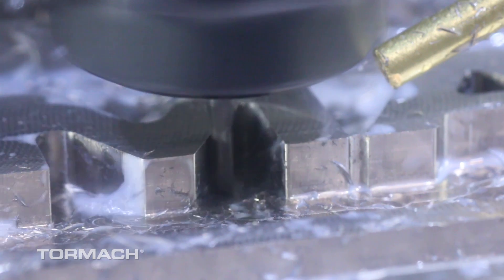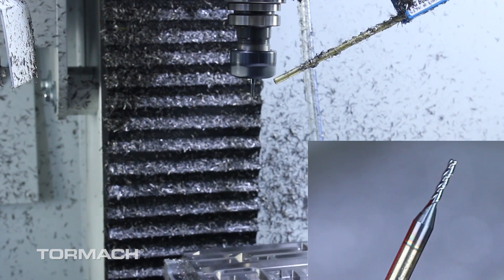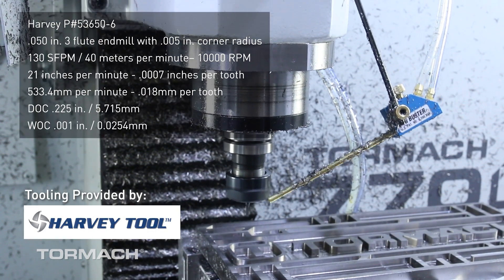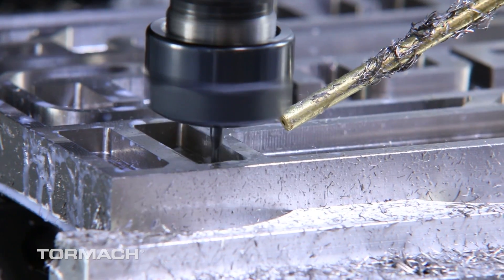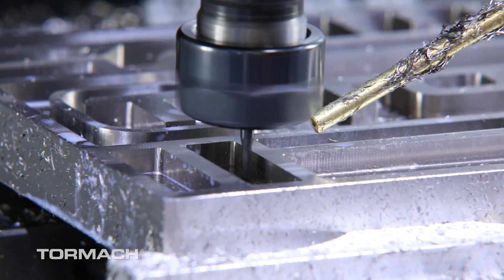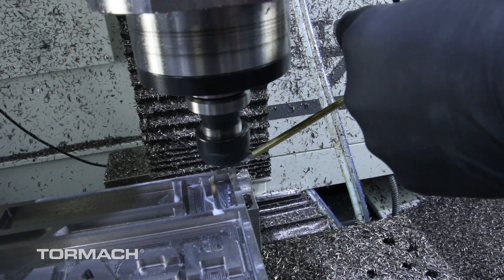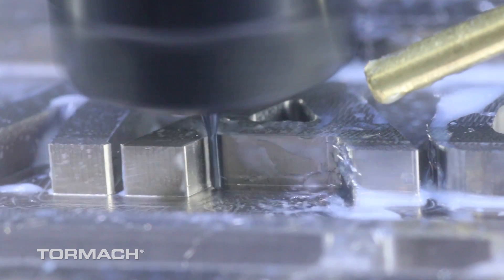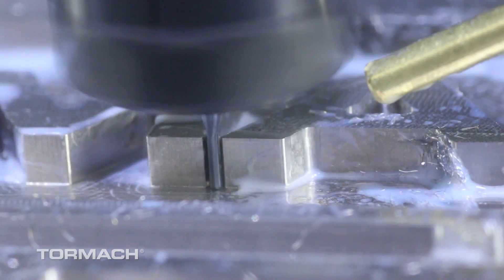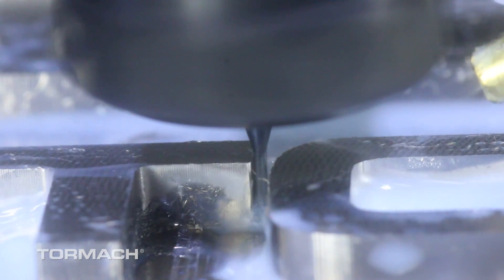The recommendations from Harvey Tool were excellent and everything just worked. Then we went down to that little 50-thousandths end mill. This tool kept making me smile — I've never run a cutter that small at that depth of cut before, so it was a fun experience, and much easier than I expected. We went full depth at 225 thousandths deep with a 2% step over, which ended up being a one-thousandth of an inch step over. One of the big things when cutting titanium is you can't be scared — you have to take a chip, otherwise you'll work-harden the material and wear out your tools. That little 50-thousandths end mill very efficiently removed all the material and I was very happy with it.